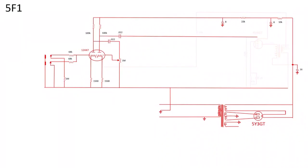The amplified signal goes through yet another coupling cap. On the way to the power tube we have another grid leak resistor, same function as explained for the preamp tube. The power tube also has a cathode resistor, but here there's a bypass capacitor as well — a small bypass cap enhances treble, while a higher value uniformly increases gain for all frequencies. The 6V6 power tube is a beam tetrode, so besides cathode, plate, and grid, we also have a screen which attracts electrons to the plate, whereas the grid repels them.